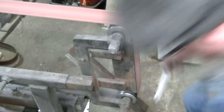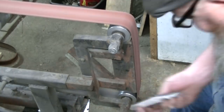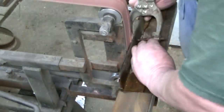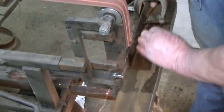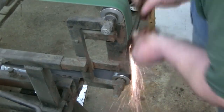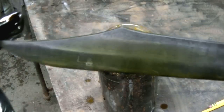We're going to go ahead and keep grinding on this guy and get it into a bevel jig to establish our bevels. And we'll take as much meat off this as we can. We need a pretty good established blade shape and width, length, curvature, all of that, so that we can plan this handle really well. It's not something that we can trial and error too much, so.